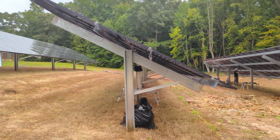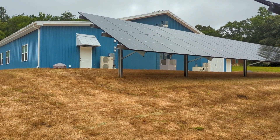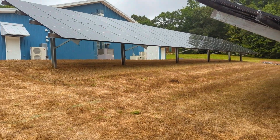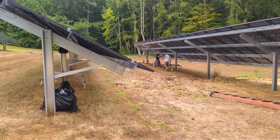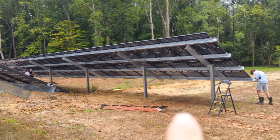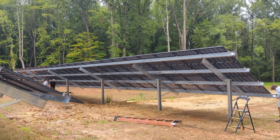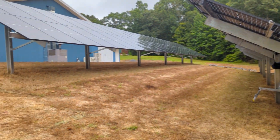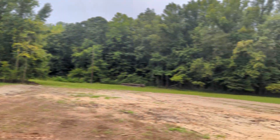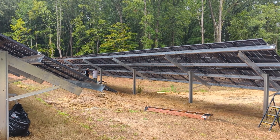The system had been working well for a couple of months, then this building got a couple of apartments with a lot of HVAC added. There are multiple homes, multiple buildings, a lot of HVAC, and it's been really hot, so the battery couldn't quite cut it. Part of the problem is the property line — aesthetically they wanted the panels to line up with the building, but we don't get very good morning charging, only fantastic afternoon charging, so we added a lot of panels to compensate.